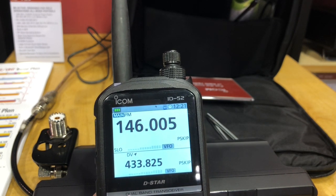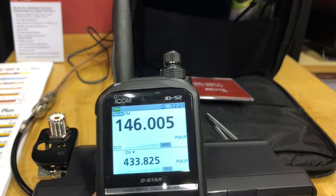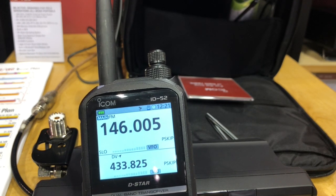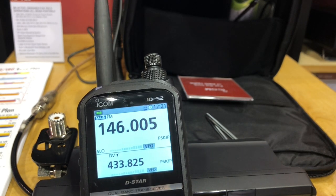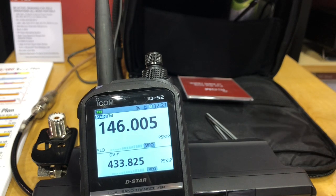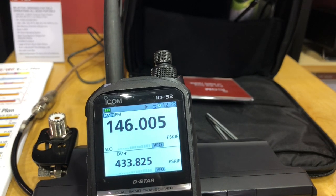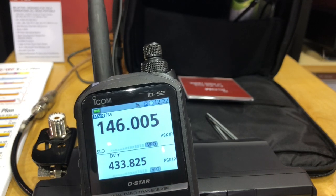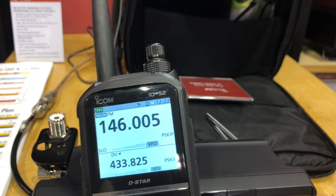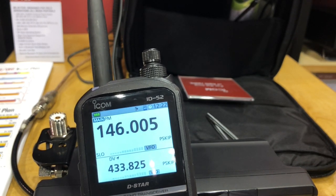Bluetooth is on it. What does that do for us? A Bluetooth headset. We have the VS3, which is a Bluetooth dongle for push-to-talk or VOX. The three protocols it supports are HFP — hands-free protocol, HSP — headset protocol, and SPP — serial port protocol. At Oshkosh with one of our aviation handhelds, a customer asked if they could pair to their AirPod Pros. We put it in pairing mode, turned the radio to VOX, and they had hands-free with their AirPods. Some cool things to try.